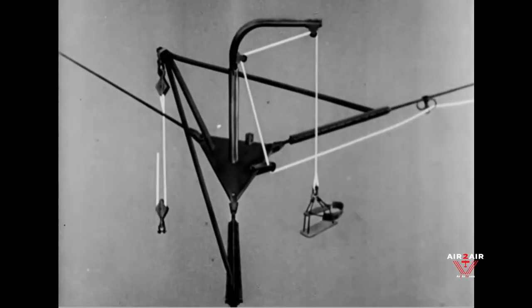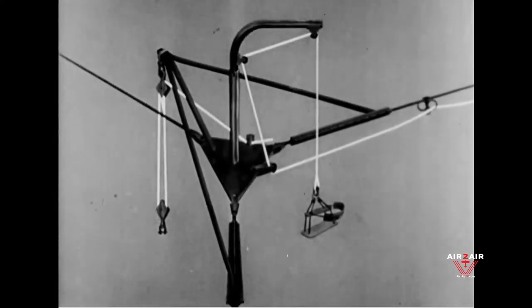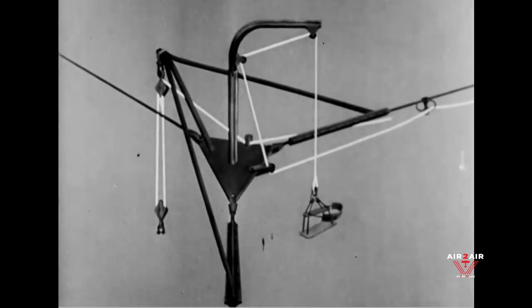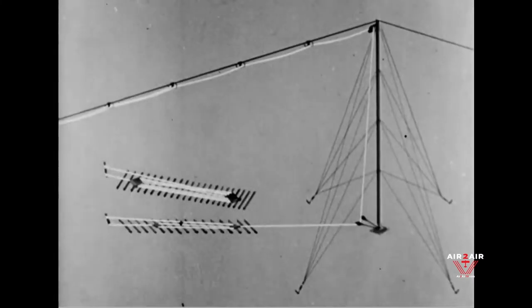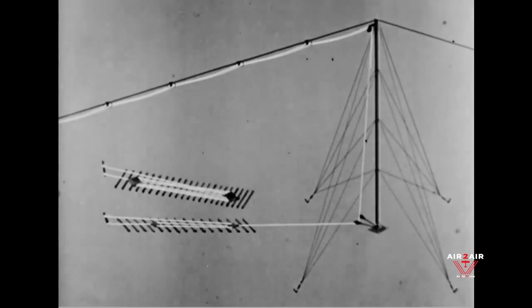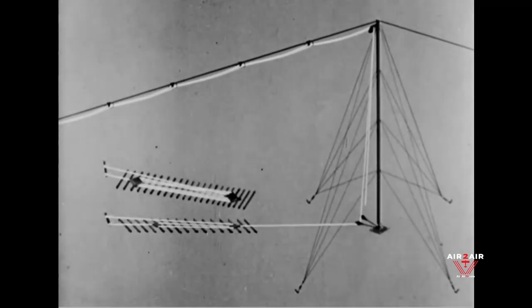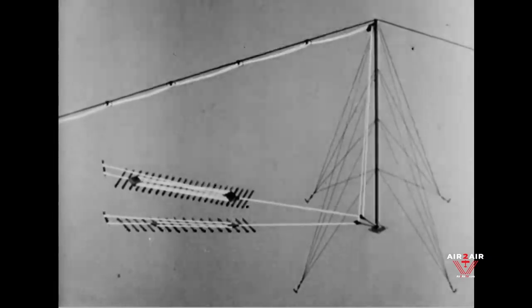The plane lift is also operated by tackle, which runs over another sheave located at the triangular plate, through another eye of the triple-eyed fairlead, back to the block at the masthead, and down to a separate single block at the base plate, out to six purchase blocks and attached to a snubbing post.